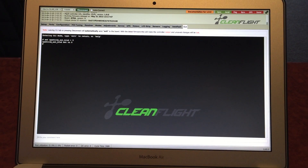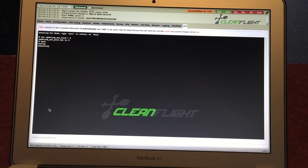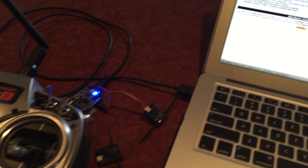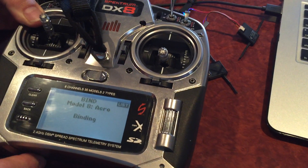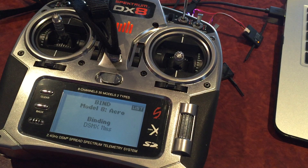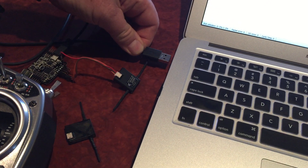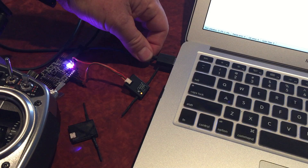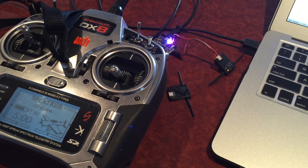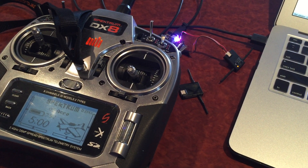That's nine — save, disconnect, recycle power, and we'll bind again. There it is, DSMX 11 milliseconds. I'm not sure what happened on the first attempt — I might have put in the wrong code or there may have been a slight hiccup — but with nine, that's the value you should get. We're now in DSMX mode and, as I'll show you, there's no brownout detection — the light becomes steady when you recycle the power. So that definitely confirms DSMX mode. That just shows you the four different modes — anyway, thanks for watching.